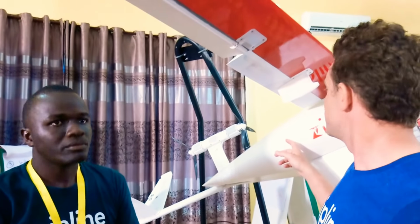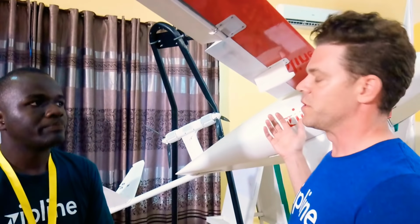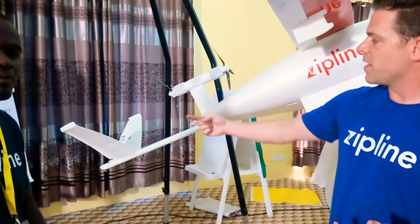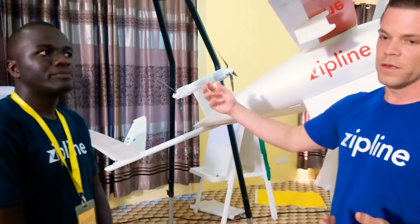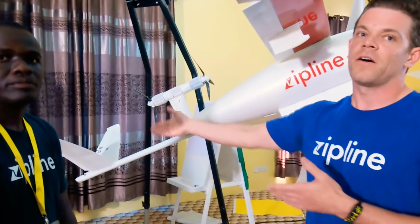And we have high level and smaller level, right? So the 3 highest levels of the aircraft are the wing, the fuselage, and the battery. And then, of course, each of those pieces has line replaceable units as well. So like the fuselage, these tails only have 4 screws on them, and they have a flexible cable in it with the servo gear on it. So if the tail breaks, you just slide it off and screw another one on. So that also is an LRU, right?